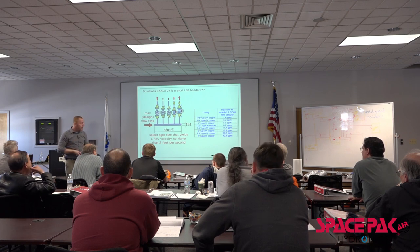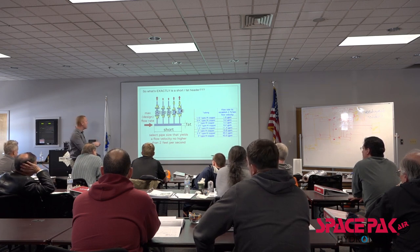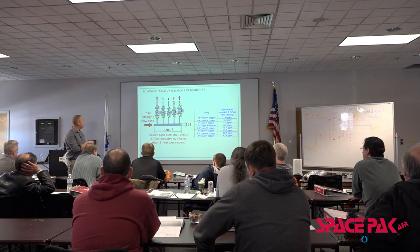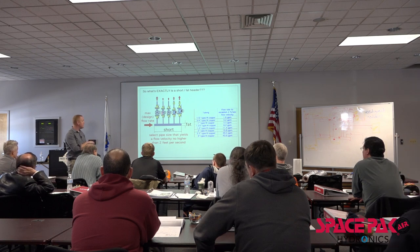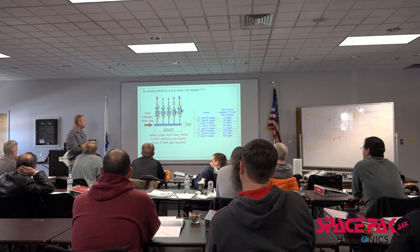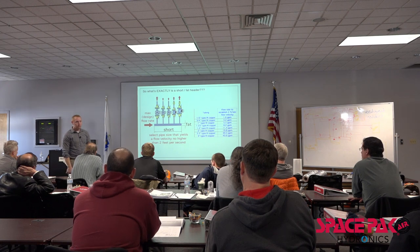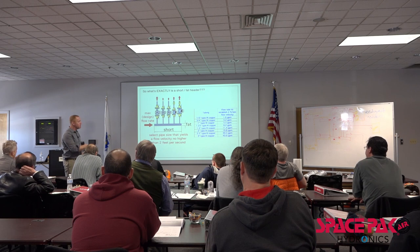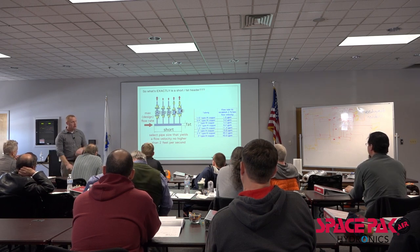So everything varies. But keep in mind that if we had five units here that were all 5 GPM, and this was 1-inch copper, and we know we can only get 5 GPM through 1-inch copper, and two or three of those happen, what's going to happen? Now, this one might get 5 GPM. This one isn't going to get it. Before you go down here, we've basically used up all that water, and these units are going to be starving. You might be able to pump 2 GPM through them, barely. So it's important to have that. That same hydraulic separation is happening here the same way it does in the buffer tank.